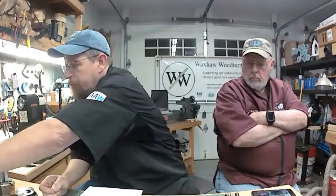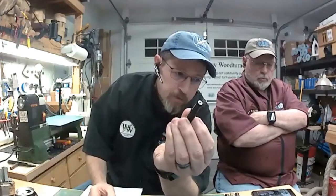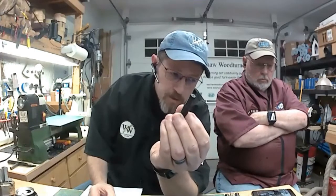These are all laid out in the instructions, but you're going to need a quarter inch, 5/16, 23/64, 3/8, 29/64, and then the last one, which is not in the instructions, but it is on the tips page, is a small drill bit. You can see that. The small drill bit has a specific purpose: you can drill a hole in the top of the cap inset to let air escape when you epoxy this into the blank. And we'll go into that shortly.